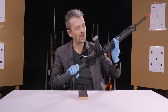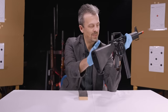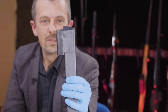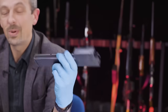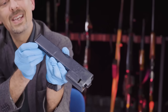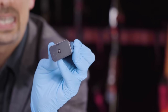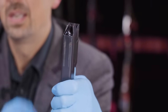Took it off the rack and laughed out loud. Have you already guessed what it is? Let me take it off and show you the magazine. Very characteristic rib or negative pressing on the back there, the witness holes, the floor plate, slight taper, and just faintly, the arrow showing you the direction to take the base plate off when you disassemble the magazine. The infamously sometimes problematic feed lips. This is a Sten magazine.